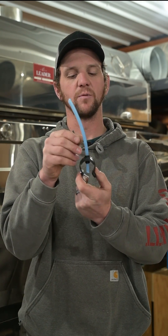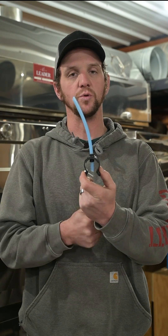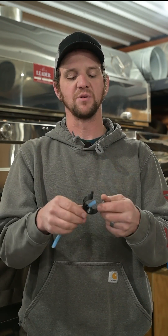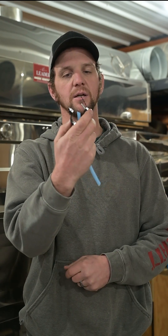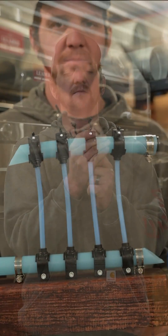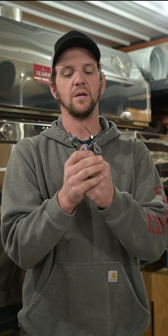At the bottom of our main line we're going to use this to lift the sap up, and we're going to use the same saddle in our upper main line just like that. When the sap comes out, it falls directly out and it can't go back down the 3/16 line.